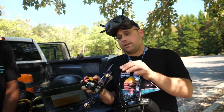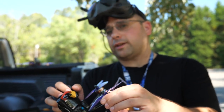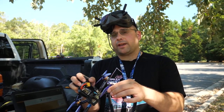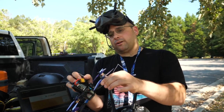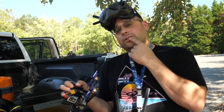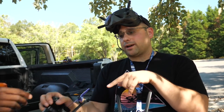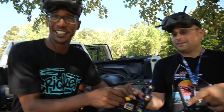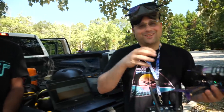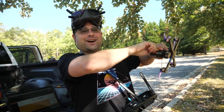Here's the rule of thumb: if you pinch the motor and it feels kind of hot but you can keep pinching, that's probably okay. If you pinch it and go 'oh oh oh,' that's probably too hot. And if you've got calluses on your hands — if you're a chef with iron hands — use your lips. I know this sounds dumb, but your lips are really sensitive. Just touch the motor to your lips. Not while the battery's plugged in though.